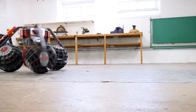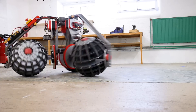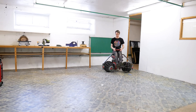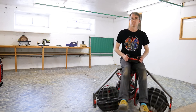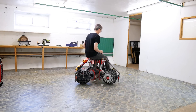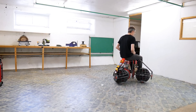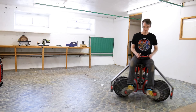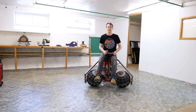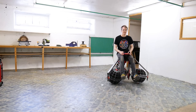The question you really want answering is — can I ride on it? And the answer is yes, very much so. In fact it feels terrifyingly high powered due to those 1500-watt motors, all three of them, and the 3 to 1 belt reduction which seems to be holding up nicely. I can move in all directions — I have put some motion filtering on here although it's still pretty tricky to stay on if you move suddenly. I've squared the stick values and scaled them back down so we get far more control when you move the stick a little bit but still get full speed when you move it a lot. I've also put a first-order filter on which causes deceleration, but it's still really easy to throw yourself off it.